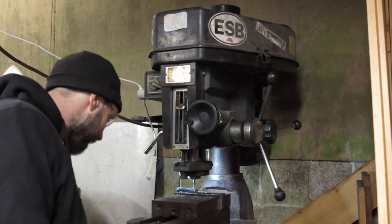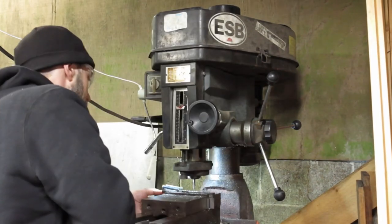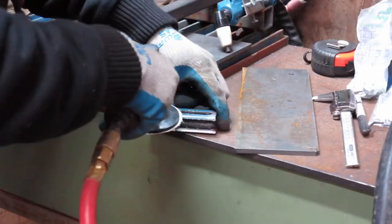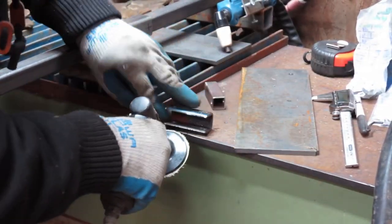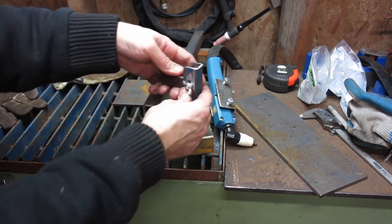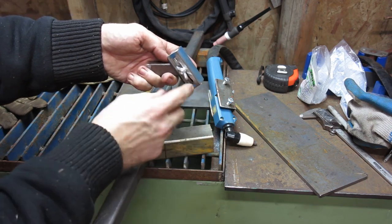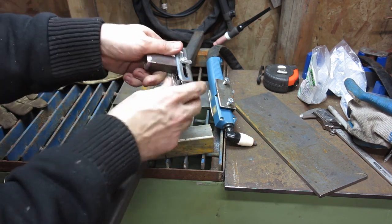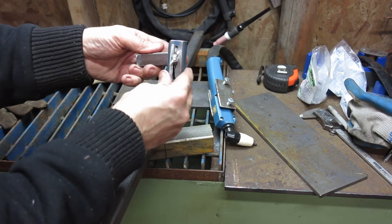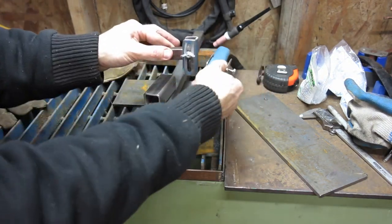Almost done with the part here. There it is — we'll go clean it up. Here's the finished part. It's going to be tool-free so you can move it up and down. This is going to set the height of the torch for different pieces of metal. You're also going to be able to kick it at a 45 for cutting bevels. I might put a little allen set screw to set the 45 degree angle and to set it 90 degrees. This is going to sit on the slider — the torch is going to get welded to this.